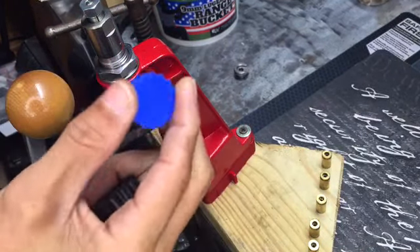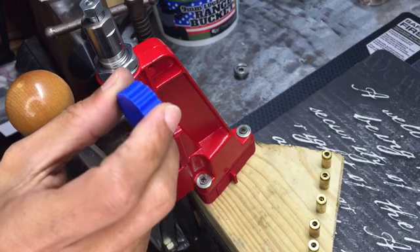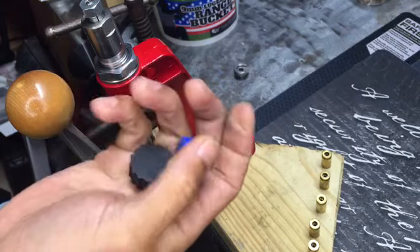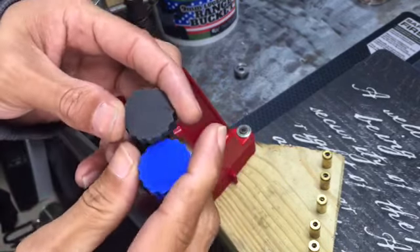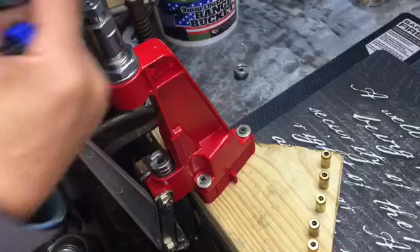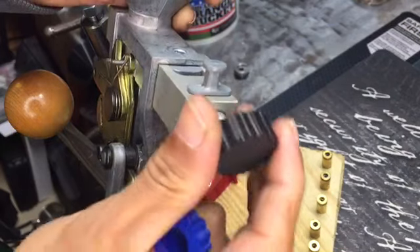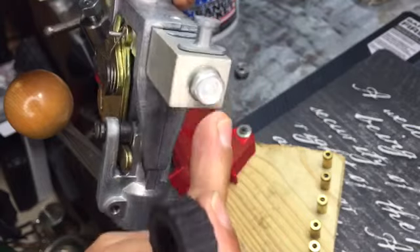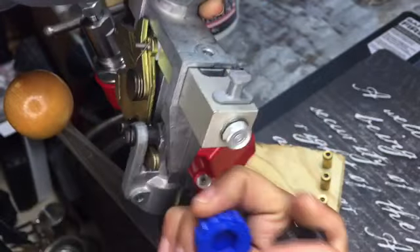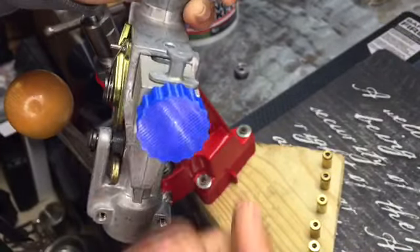A lot of people make these knobs here — otherwise you gotta use a wrench. He 3D printed these also, so I can put it on my Dillon powder measure. When I need to adjust my charge, I can move it up, move it down, to fine tune it. One of them he sent me had a plus and a minus on it, so that is the one I put on one of these powder measures. Look at that — that's the Dillon powder measure. You take this nut — a 7/16ths nut — goes right on there. The blue goes right on there too. You can adjust it like that without using a wrench. Makes it awesome. Super cool. Super easy. Reloaders, you know — we like easy.